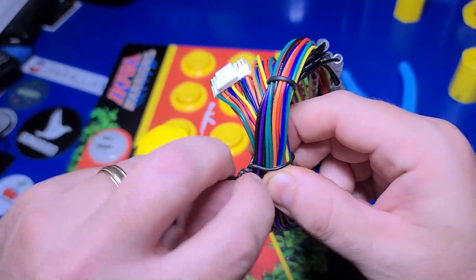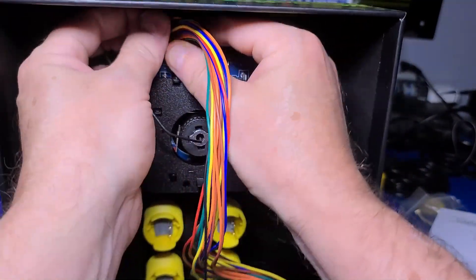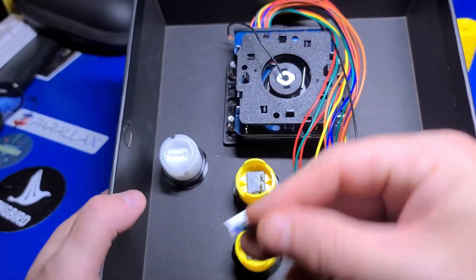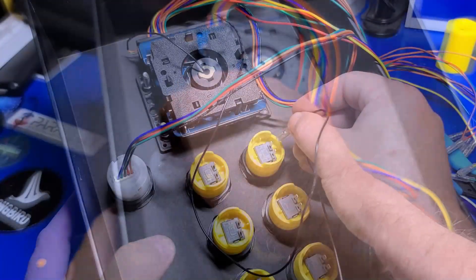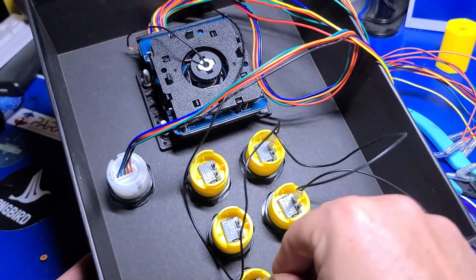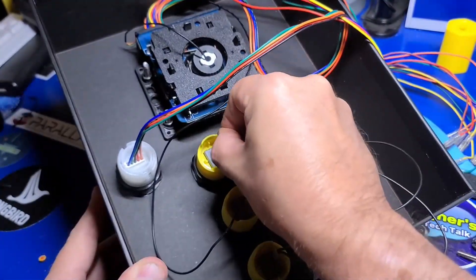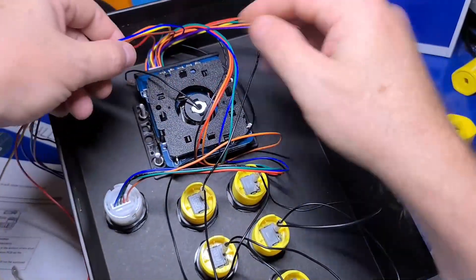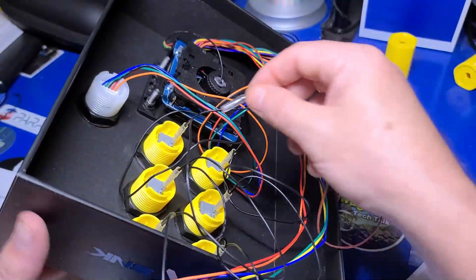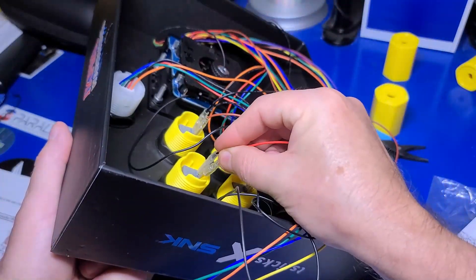Remove the ties holding the wiring harness, then plug in the harness into the port labeled J2. Make sure the connector is firmly seated into place. Then plug the white connector from the harness cable into the mode way button. Starting from the end of the black wire or ground closest to the stick, begin snapping in the wires to the negative terminals on each of the buttons. Keep in mind you will have six left over when you're done. In this early kit the wires weren't labeled, but yours will be according to Glenn. I separated the wires needed for the six buttons and went by the color chart in the manual to wire each of them up.